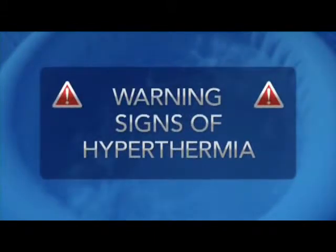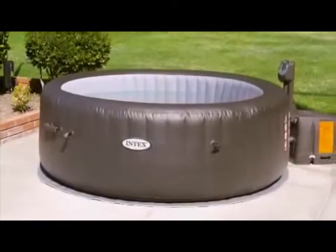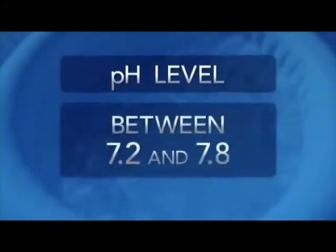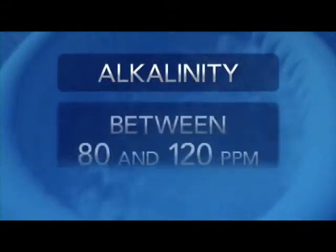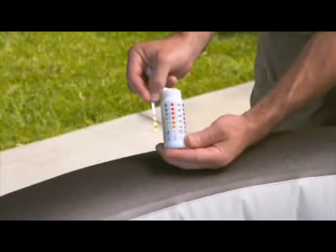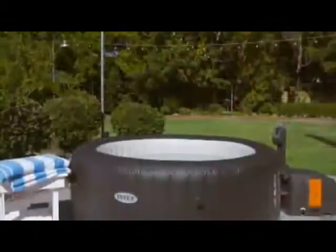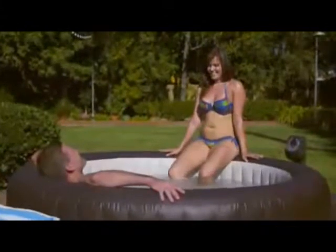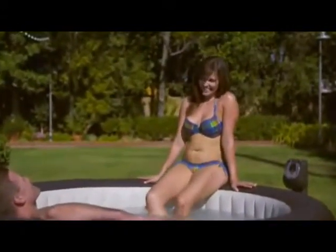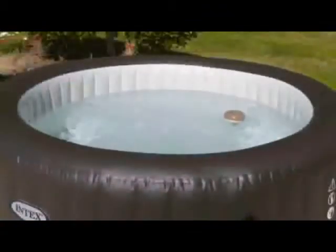Hyperthermia effects include failure to perceive heat, unawareness of the impending hazard, and the need to exit the spa. Maintaining the proper chemical balance in the spa is very important for spa life and safe water. Keep the spa pH level between 7.2 and 7.8, alkalinity between 80 and 120 ppm, and free chlorine between 2 and 4 ppm. We recommend that you test your water chemistry weekly using the included test strips. When adding chemicals to your spa: do not add chemicals when the spa is occupied, add chemicals separately, and you may activate the spa jets to help dissolve and distribute them. Use the included floating dispenser to add chlorine, and follow the chemical maker's instructions to avoid hazards.